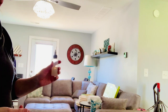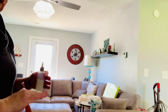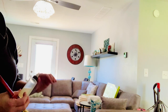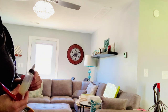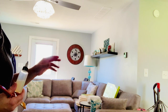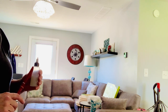The big difference between this and epoxy is you have to put a few more layers on. Epoxy is very thick and you can put it on in various thicknesses and it will self-level, with maybe one or two coats to sand. The process for Bright Tone is it goes on very thin — the target thickness is the thickness of two pieces of paper. If you put it on too thick, after about three or four layers it'll start to get that ripply orange peel effect, which means you've put them on too thick.